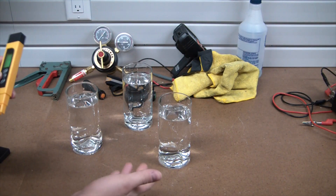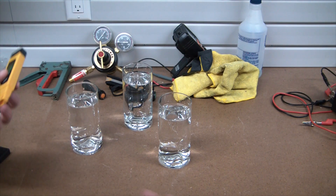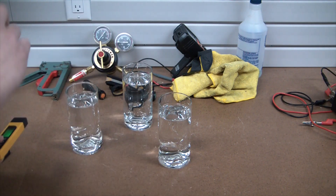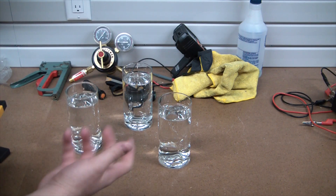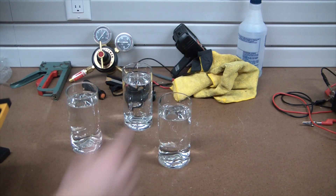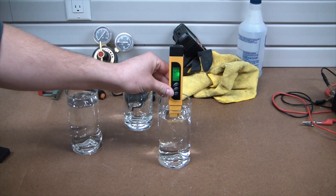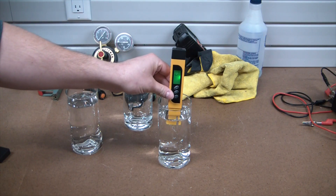And now here is what's called reverse osmosis water. It uses literally the reverse of osmosis — it uses water pressure to force water through a membrane, leaving the saltier liquid behind, which it then rejects and disposes of in the sewer. This should be maybe 30 or so — oh, five! Yeah, that's pretty damn good.